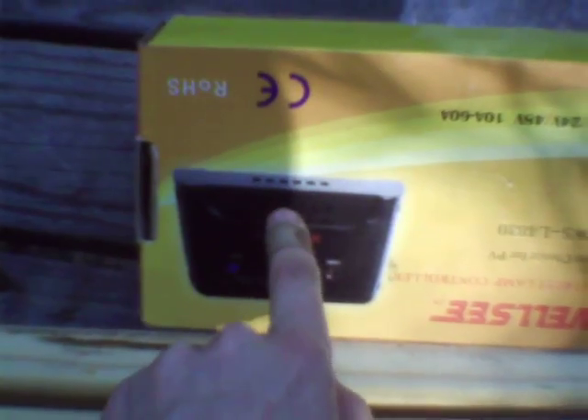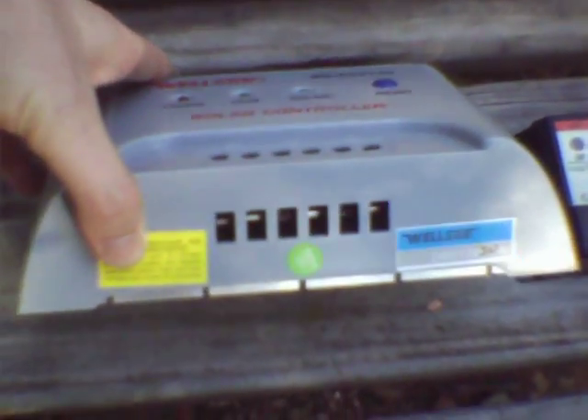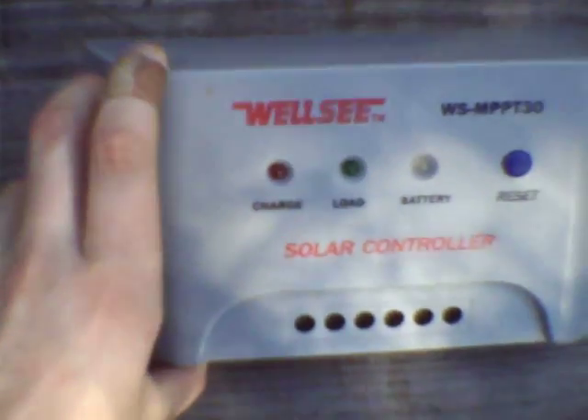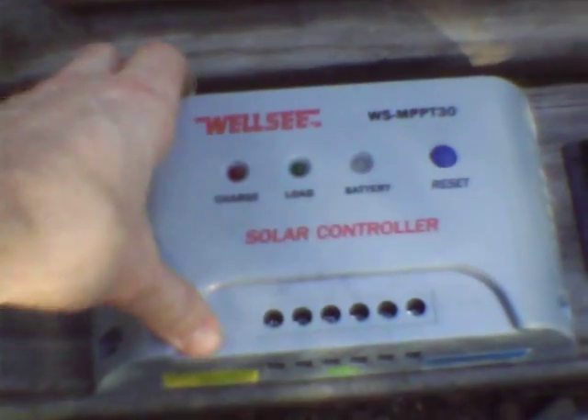Considering the quality, and knowing that 48 volts is within the realm of electrocution, I would not trust that. And even this unit that says it's dual potential — 12 volts or 24 volts — I would not trust that either, because your peak potential when your photovoltaic array is open circuit, if it was a 24-volt array, can get up to about 40-odd volts.